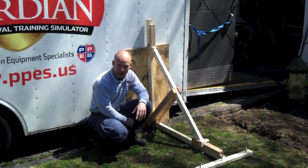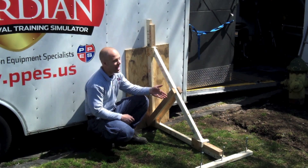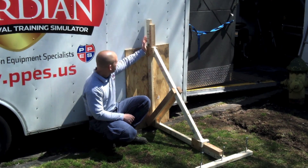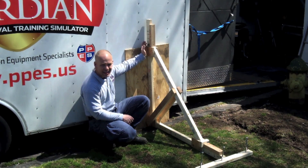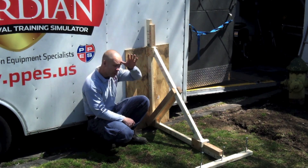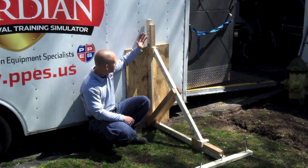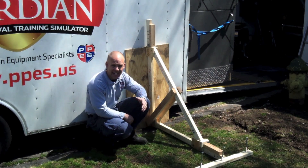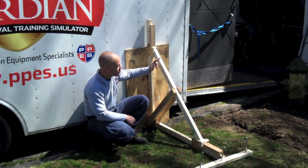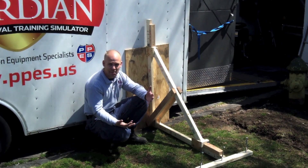Now we're back here to the 45-degree raker. The concept is the same, the only difference is the angle you're getting. When we're cutting the raker portion here, you're going to get your capture point — where you want this raker to hit to initially start supporting the load. So for that 60-degree raker, if this is 8 foot, you would take 8 foot and multiply it by 14 — that would give you the inches from point to point where this raker needs to be lengthwise. For a 45-degree raker, we're going to do 17 as the magic number.